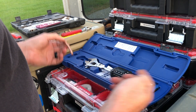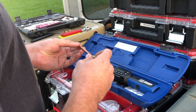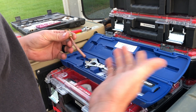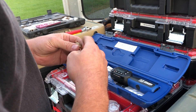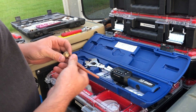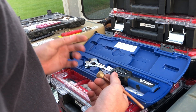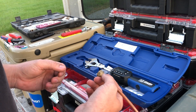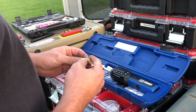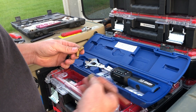One of the biggest mistakes I make is forgetting to put the flare nut on in the first place. Always make sure the flare nut is on before you make the flare, because it won't go back over the actual flare afterward. A lot of guys also tend to put additives — whether it be nylog or those little plastic-coated flare washers — in between the flare surface and the actual device they're flaring to, whether it be an indoor unit or a mechanical fitting.